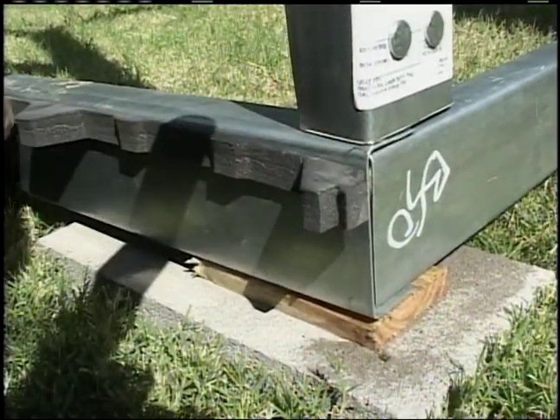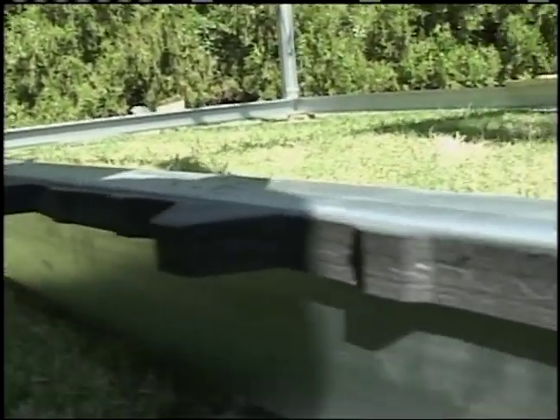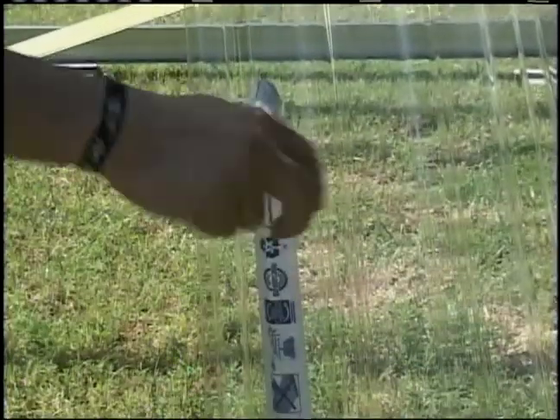Wall sheets cover 3 feet after the lap. The base channel and eave channel can be marked on 3-foot centers for a visual reference to keep closures and sheets on center while sheeting is applied.